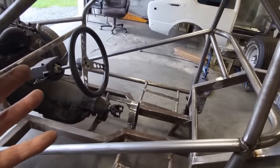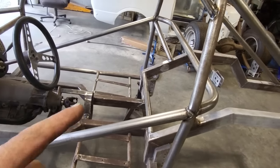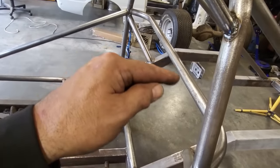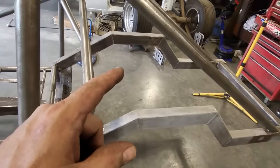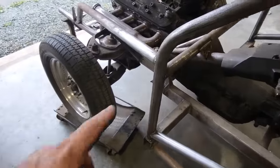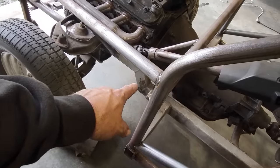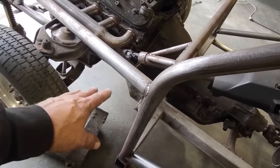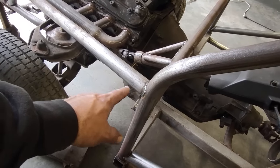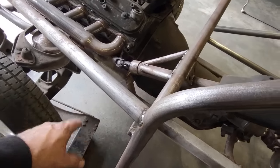That's basically it now. So the chassis now, I've been here thinking about what has to be done, okay? I got to get two seat braces put here, an anti-sway bar, a shock mount here, and then I remembered up here in front, I got to make two trailing arms for the lower control arms that'll go back to here. I got to make two mounting points for that on the chassis. I don't need to make them up right now, but I can cobble something up there to give me an idea of what I got to make up for trailing arms.